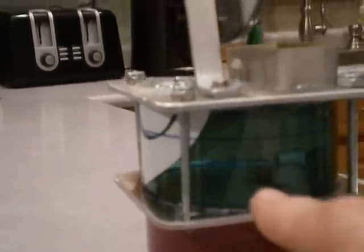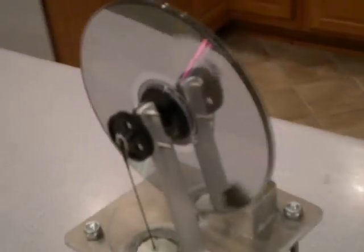As that displacer goes up and down, the air inside this chamber expands and contracts. When all the air is down on the hot side of the plate it expands; when it's on the cool side it contracts. And you can see the little diaphragm just puffing away, expanding and contracting, and that's pushing and pulling that little rod and driving that crazy little thing.